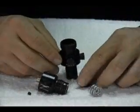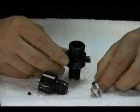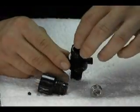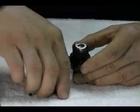To reassemble, simply place in the desired amount of shims, the thin shims: no red shims for low pressure, 1 red shim for medium pressure, 2 red shims for high pressure. Then place a spring on top. The shims may be placed in any order.